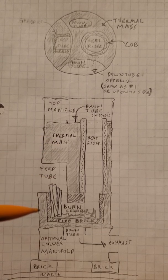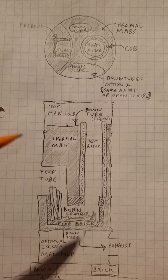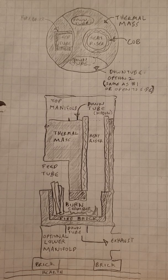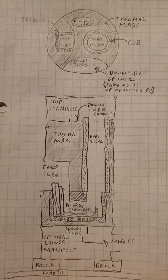The important part is to surround your burn chamber and heat riser with thermal mass, because you're not going to use very much of it. In a typical rocket heater, you'll have a three to five ton bench at around 110 degrees or so to store lots of heat overnight for keeping your house warm. But in a cottage rocket, we want something lighter.